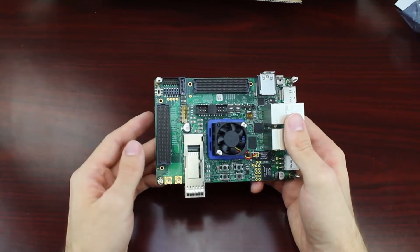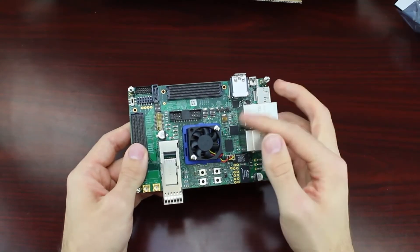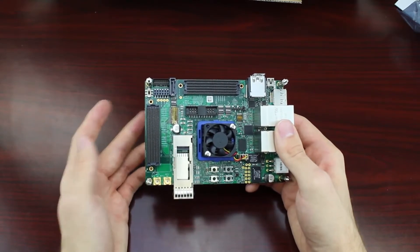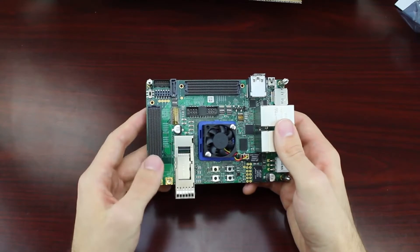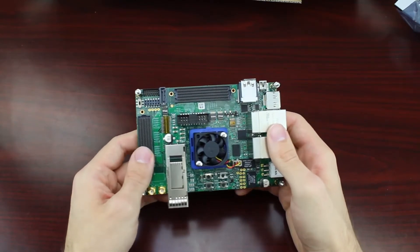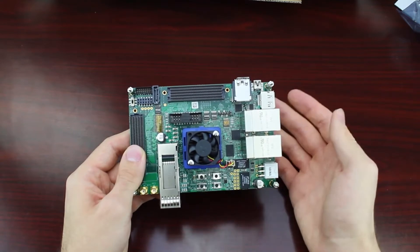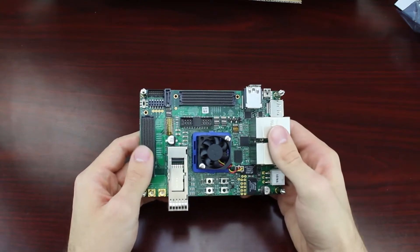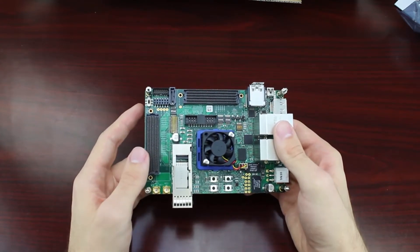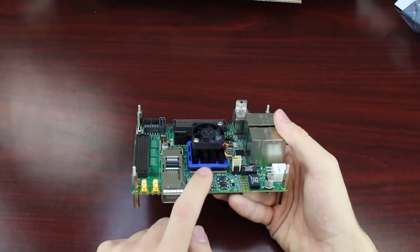There's so much more the board can offer — in addition to its image processing capabilities, this Zynq device includes the largest FPGA within the UltraScale+ MPSOC family, with 4GB of supplemented DDR4 memory available for that programmable logic. On the processing side, the board includes a quad-core ARM Cortex-A53 as its application processing unit, a dual-core ARM Cortex-R5 as its real-time processing unit, and an ARM Mali-400 as its graphics processing unit. Suffice to say, there's quite a bit of power packed in there.